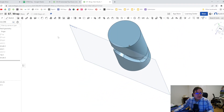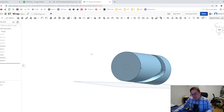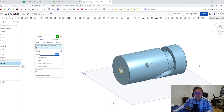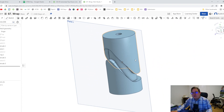To keep this video from being too long, we're going to wrap it up here. The last thing I'm going to do is throw a center circle down the center of my barrel cam — three eighths of an inch — so we have space to throw in our dowel rod for later. Alright ladies and gentlemen, we've created our barrel cam. We're going to throw an automata in the next video — stick around. If these videos have been helpful for you, please like and subscribe and drop in the comment section what you'd like to see.